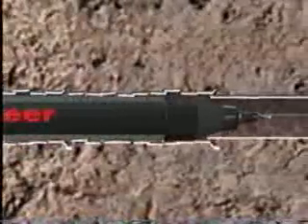With the Vermeer pipe bursting system, the pneumatic tool is protected inside the new pipe. The burst head is the leading edge used in fracturing the old pipe. This reduces tool wear and eliminates the abrasion to the tool body.